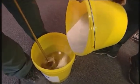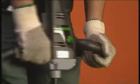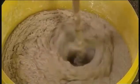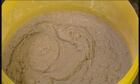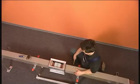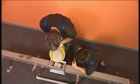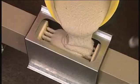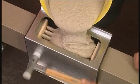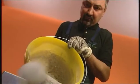Now add filler to the casting compound. Then pour the compound without delay into the fully assembled and mounted casting form. Tap the casting form lightly with a mallet so that the casting compound becomes compact.